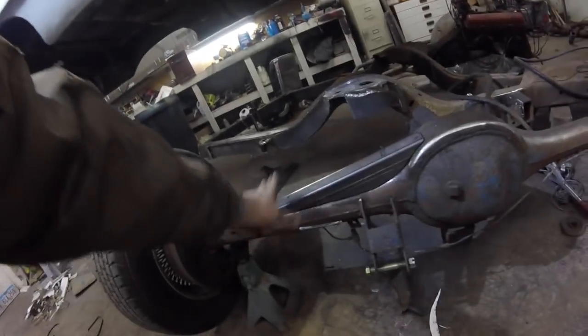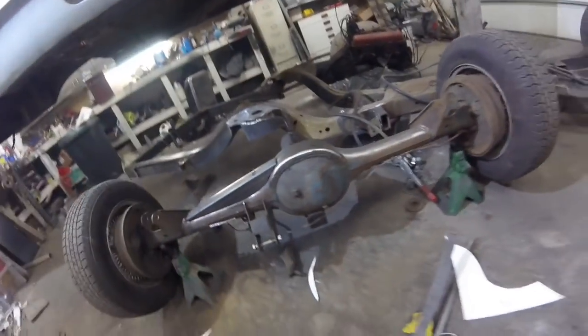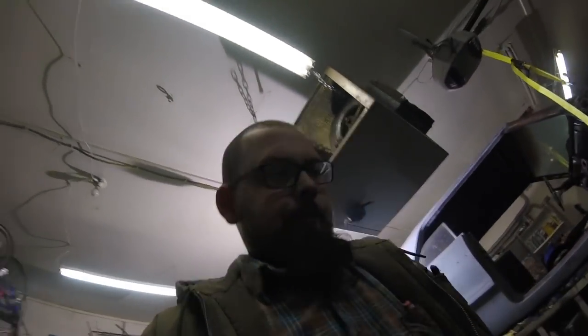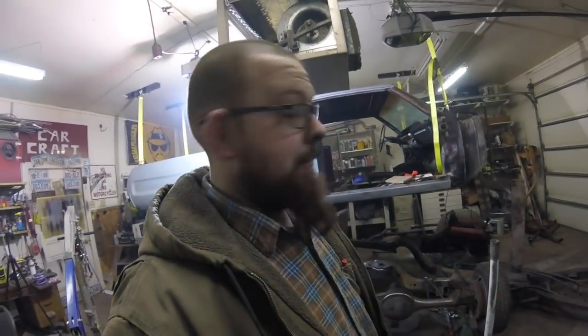I just don't think I need the big bulky boxed-up rear end — I think that's gonna be enough. Also, the cylinders don't even mount to these rear ends, so the cylinder's not pushing on the rear end at all. I don't think you really need a whole lot of reinforcement. I definitely don't think you need a six-inch stack of steel hanging off the pumpkin. Seems unnecessary, but I might be wrong — I'm gonna find that out soon enough.